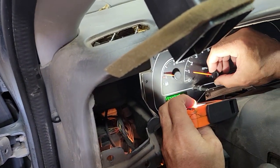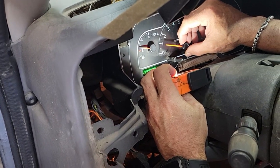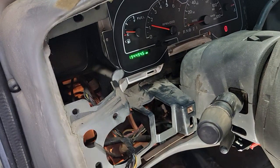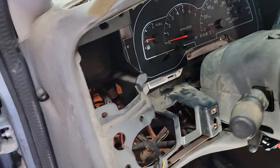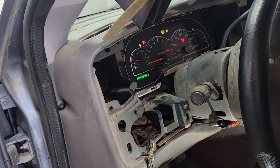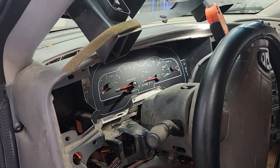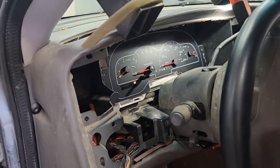then you're going to let it settle down to that idle value, and you're going to set that needle back on there at that value. I'm guessing that's about right. And we should be good. We didn't change any of the other needles, so that should be consistent with wherever the vehicle was when it came in here. And he wasn't complaining about any of the other gauges, so we should be good there.